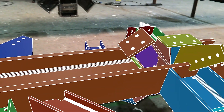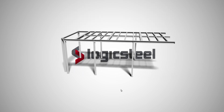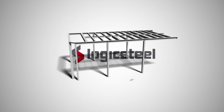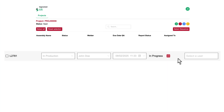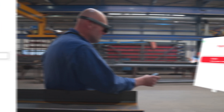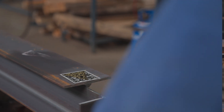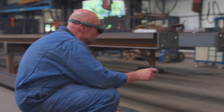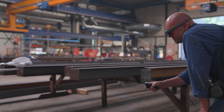As part of the Logicsteel suite, Logicsteel XR is able to retrieve your BIM model from Tekla and SDS2 with precise quality. Simply export your assembly to Logicsteel XR, mark it for quality control, select it within the XR headset, place a single QR code and you're ready to inspect. Whenever an error is spotted, a photo or video can be easily made with the push of a button.